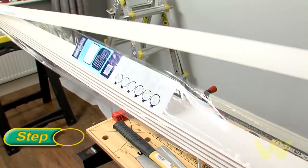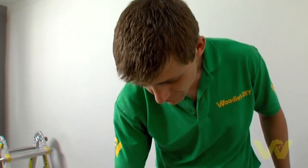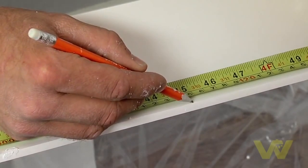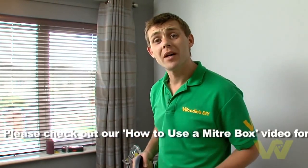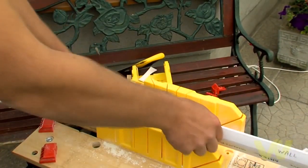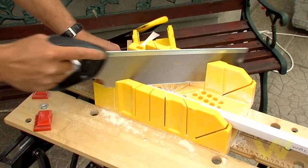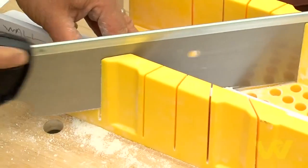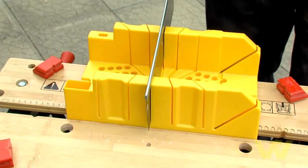Start on the longest wall. Measure and cut a length of coving. When measuring and marking a length of cove, always measure along the wall guideline. Transfer the measurements taken from the wall back onto the cove marked wall edge and mark the position of the cut required, marking up to the lip of the cove. When you have to join two pieces of coving together, always use a miter joint as this increases the surface area for adhesion and it's a harder joint when done well. For joining two pieces of coving together in length, to cut the right-hand piece, simply place it in the miter box making sure the wall side of the coving is against the side of the box closest to you and the ceiling side of the coving is in the bottom of the miter box. Cut from the bottom left to the top right. Alternatively, you can join two pieces of coving together using a 90-degree butt joint. This is easier to do but the finish is not as seamless.